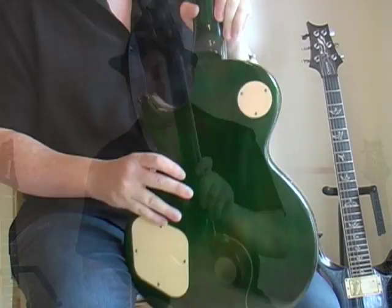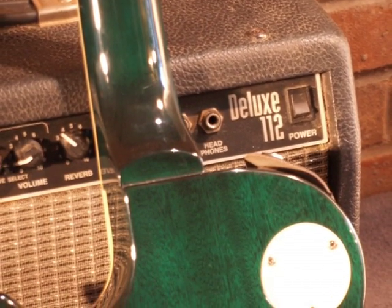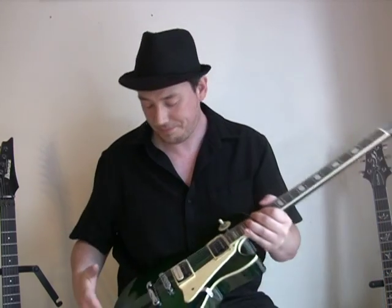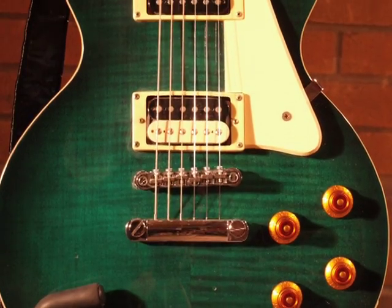Starting with the Les Paul, we've got a body of mahogany, and a mahogany neck which is glued into the body. So this is a set neck that takes quite a bit of skill and time and effort to get right. We have a maple top which is carved, so it's not completely flat. Mahogany, very dense wood, hard to work with. Maple also, both kind of expensive woods.